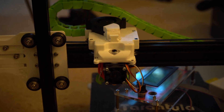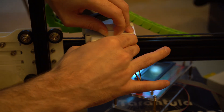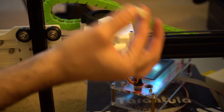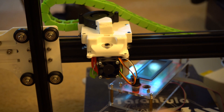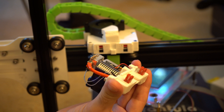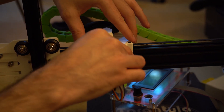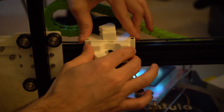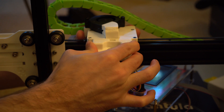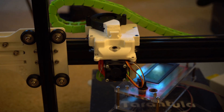The coolest part about this whole thing is you can create different hot ends so that you can plug them and unplug them. And that was just really hard to take out. But basically this comes off — that's what kind of holds it in — and then this just snaps off. Boom. And then if I had another hot end, I could plug it back on just as easy like this. Push it in — I don't want to break it. And then that goes in there like that. Boom.